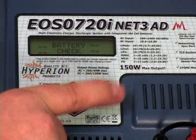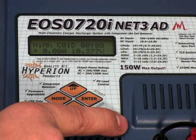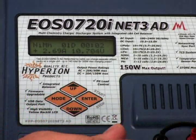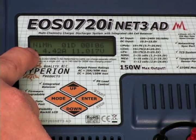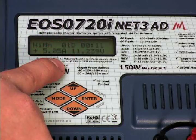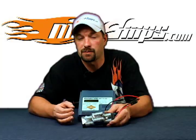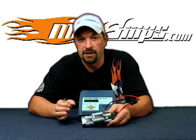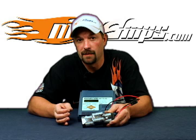Press and hold enter — it's going to do its battery check like normal. Now it's starting the cycle process. It's going to start by charging the pack; once the pack is full it should sound off a tone, then go into automatic discharge mode and take it all the way down to 0.8 volts per cell. When that cycle is done, it's going to let the pack sit for 15 minutes to cool, and then it will automatically start back up again.